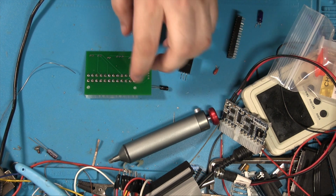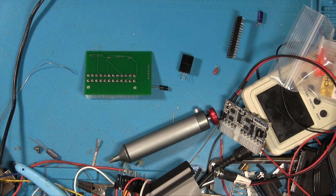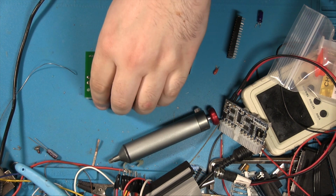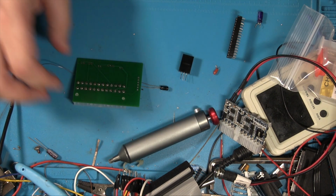Right. I did them in a weird order because I was toying with just doing the pins I'm using, but I did them all in the end. I haven't put a lot of solder in. Normally you'd want the big peaks like you see on smaller solder points, but if this is wrong, then I want to be able to rescue this plug if I can, so I put less on there.